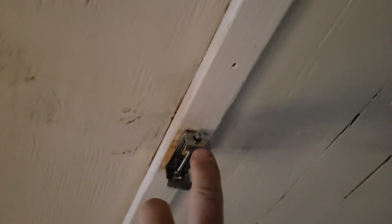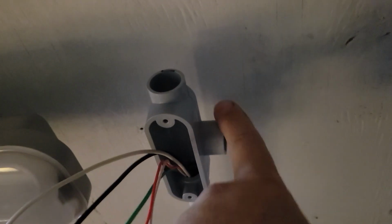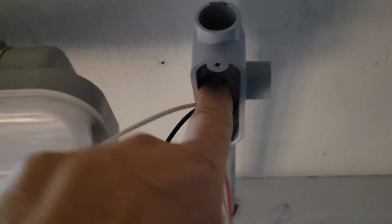What I'm going to do tonight is, you can see I've got the locking mechanism in these two positions. This is the position in the quote-unquote phase one where the light fell the other day when we were talking about this fastening system. This one is affixed over here. The line is run, the wires are run, and what I'm going to do is hang this light that I'm working on tonight. The wiring is going to go through here, and then I'm going to have the continuation to the home run and have the wires pop through there and do all the connections here and put the little cap on it. Cinch that thing down, and that'll be the next one I'll put the switch in.